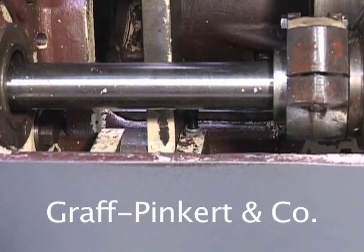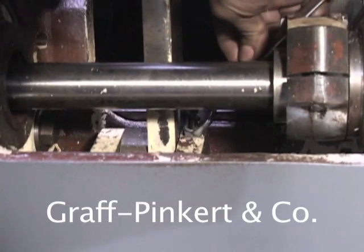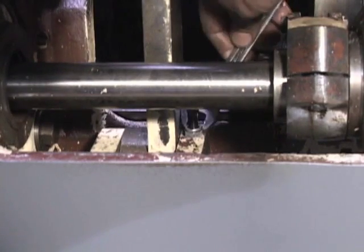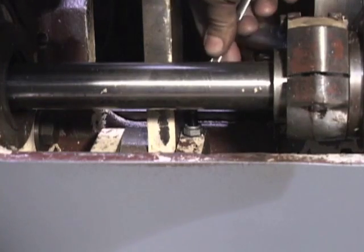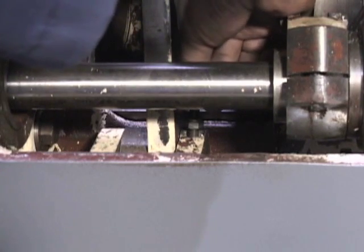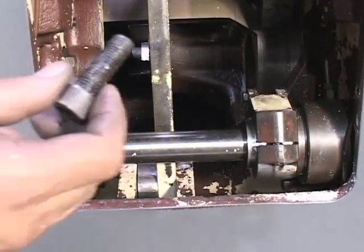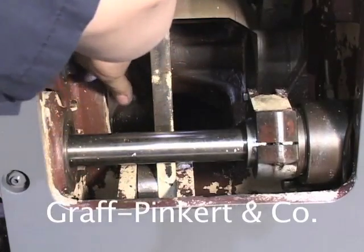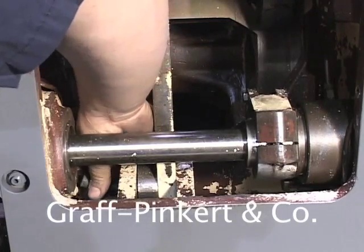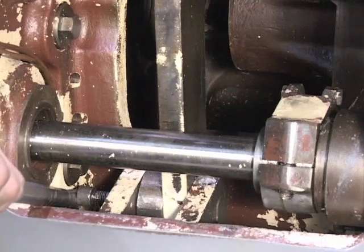There is now one link remaining — the left one which connects the upper slide. Remove the taper point screw which holds the pin located between the two links. This is at the end of the forked intermediate lever. Extract the pin; if it is tight, insert a cap screw into the pin and pry it out with a bar, removing the link.